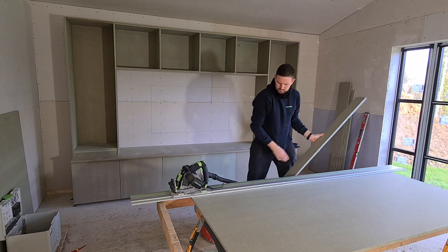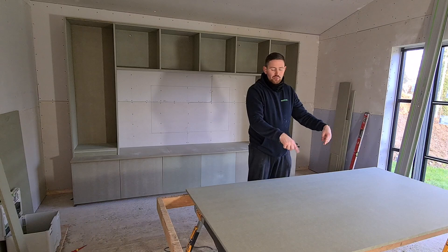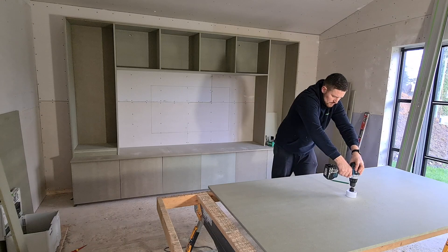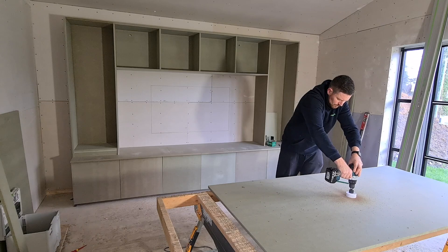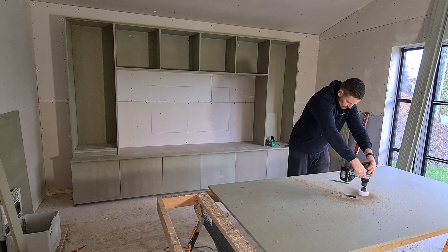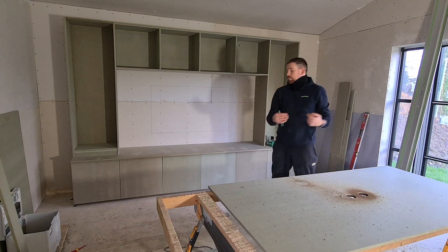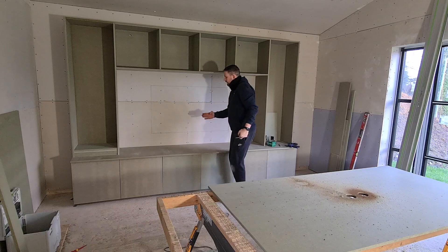So that's our backboard cut. Because this is a bit difficult to lift into that hole and it's going to be quite tight, what you can do at this stage is just drill some little holes in the middle there just to help you get your fingers in. We'll just use a hole saw for that. So we've got our holes cut. Now we can offer that backboard into position, just make sure it fits roughly — we want to be sliding that back to about halfway, so about 200mm deep.